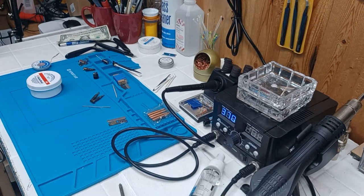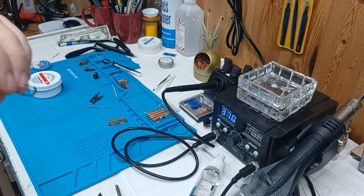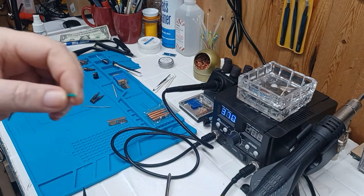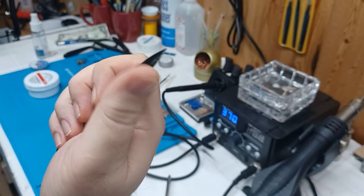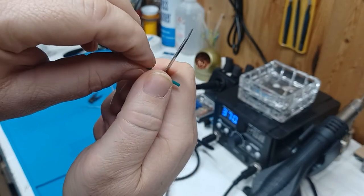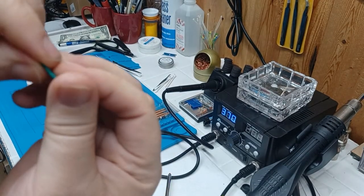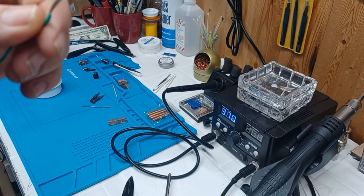So you've got this wire here — it's real thin. These strippers maybe don't go small enough, or you keep stretching wire off of there, and you want every strand you can get because it's already thin wire. Here's how you strip the wires, especially for your mic cords. Take your knife — it's not real sharp. You set it down on there on your thumb, and you roll that wire, just kind of score it. You know you've scored it all the way around without cutting the wire. Get in there a little bit with your fingernail and pull — not a single strand left behind.